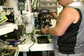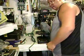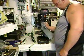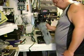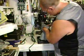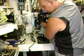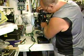Oh, that's actually nice. Nice and tight. Now there's a bit of transfer oil on this, so we want to get that off. So we want to wipe that off really good, because the chuck is compression fit, because it's tapered, and we don't want it to zip off on us. So we want to try and get that as dry as possible.